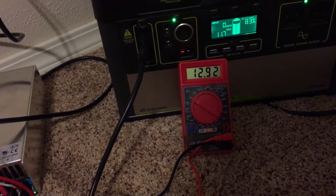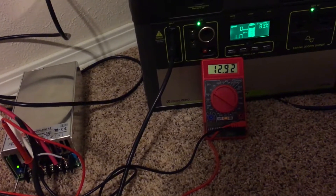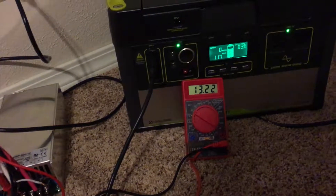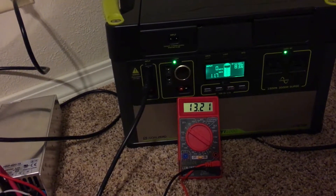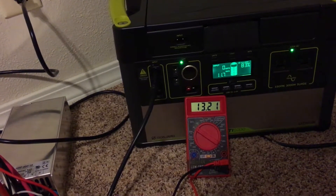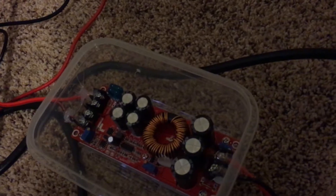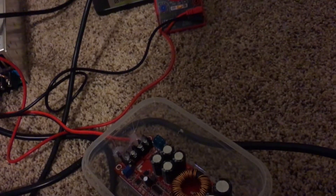I'm going to set it to 13.2 volts, because that's what a lot of car alternators output. I'll turn this clockwise to around 13.2, and you can see — at 13.2 volts, nothing is happening. That is one of the reasons you cannot use the regular adapter that Yeti sells; you have to buy the $40 version, which is basically a 12-volt boost converter bumping voltage up to 15 or 15.5 volts.